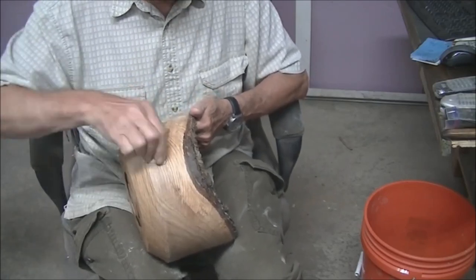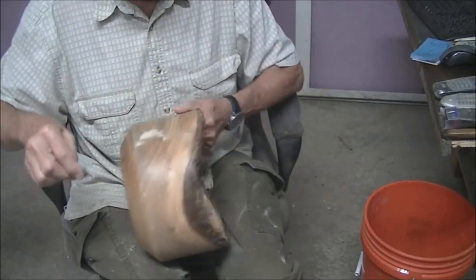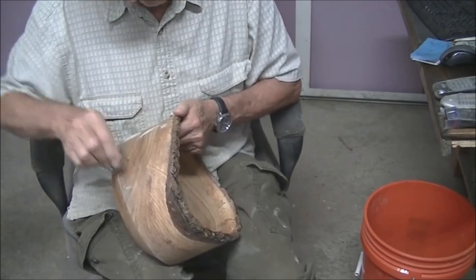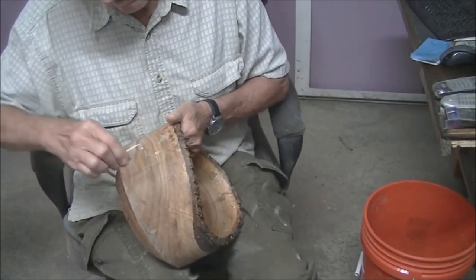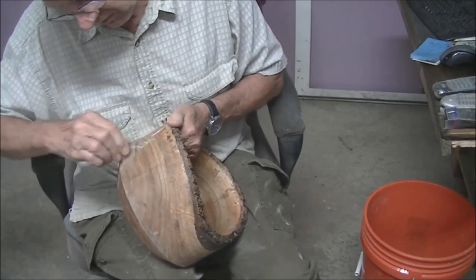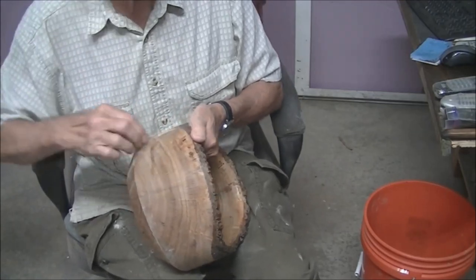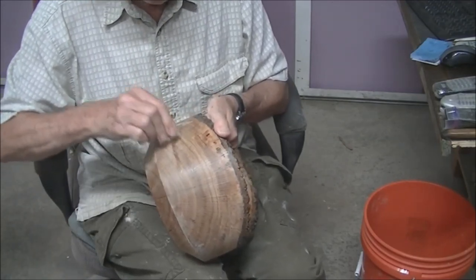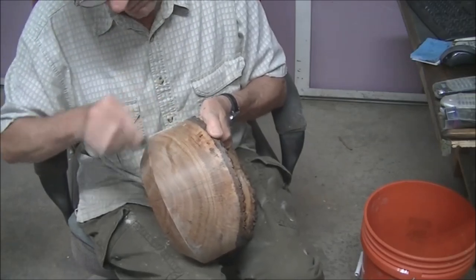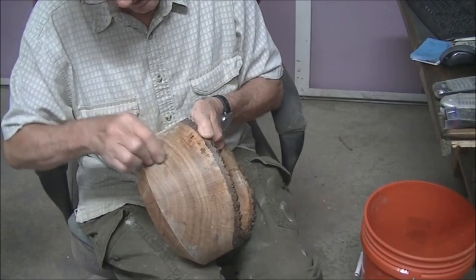What I intend to do is hit this lightly with some sandpaper, then spray it with polyurethane after I finish the bottom. Here what you're seeing is some raised superglue. Superglue is a little harder than the sealer so it has a harder time, but it will smooth the top just like everywhere else. There was a high spot there and it's gone.